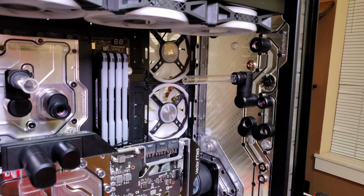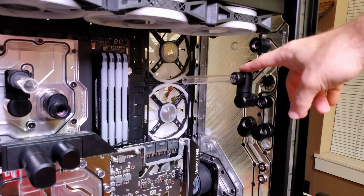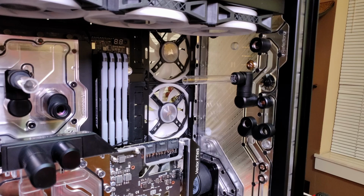And so as a result, I've gotten a little bit creative here. You can see other people's solutions too. But basically, you need to cross them over each other, the tubes. And in addition to that, I found that they're not exactly lined up vertically either. So I have taken some measurements, and this is my dealing with that. So on the outer side over here, which needs to come out, cross over the right-hand side there and attach to the inner left-hand most piece of the distribution plates. I have used two 90-degree rotary adapters on each side in order to offset vertically enough to kind of get out of the way of the other run.